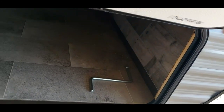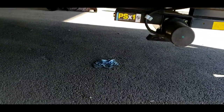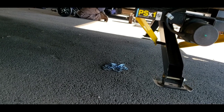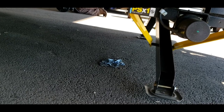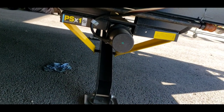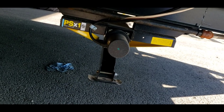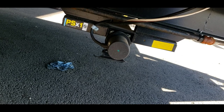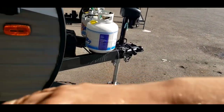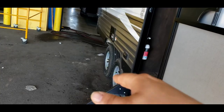And here is that crank for the backup for the tongue jack. You have these stabilizers right here — and keep in mind, I said stabilizers. These are not levelers. They're not meant to handle picking up the weight of a trailer, just to stabilize it. If the ground is uneven, one will touch and then the other one will keep going — that's all you want. You don't want to over-extend them. You can trip the breaker that's in there — there is a self-resetting breaker that can get tripped if you were to over-extend or over-retract them; that's going to save them from getting damaged. However, if the breaker were to fail, you could bend the jacks. So just keep in mind they're not levelers, they're stabilizers. If you want your trailer level front to back, use your tongue jack to raise and lower the front. If you're really worried about side to side, as you back it into the spot, back it in onto some blocks on the low side to get it leveled side to side.